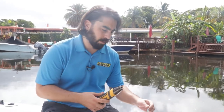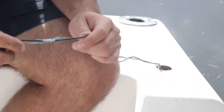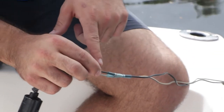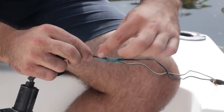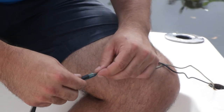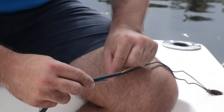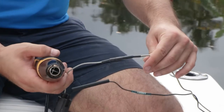Now I'm going to take my heat gun and shrink the tubing around the wire. What we're looking for is pretty even coverage — this looks fairly uniform across the wire. You'll see a little bit of the adhesive come out of the back; there's a little ridge around the whole wire, which means we've got a good seal. There's no water that's going to enter from either side — these are watertight seals. Then we'll put this secondary heat shrink right over the top; this is just a secondary form of protection to cover the butt connector as well.